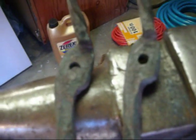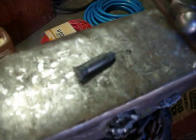3/8ths — this will be meant for a heavier duty set of tongs or whatever it is you're making. I just have the holes punched through that are like 3/16ths or 1/4 inch, so now I'm going to drift them out to 3/8ths and set this pair of tongs together. Thanks for watching.